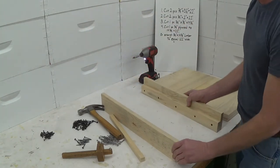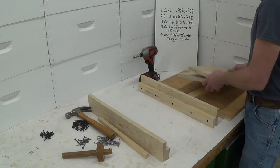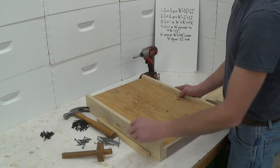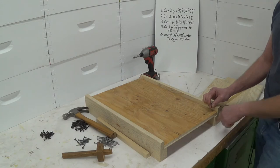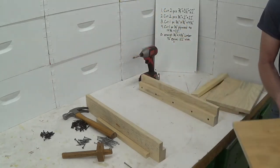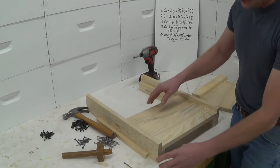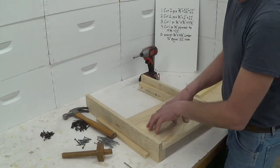The next thing I do is install my bottom piece. I'm using the plywood — it's nice, it's one solid sheet. I would use the six-penny nails and nail down through into the rim. I prefer to use the pine because it's all lumber that I cut myself. With the pine, I go ahead and nail it — the wide pieces each flush on the end, and then I fill in the center with the last piece.